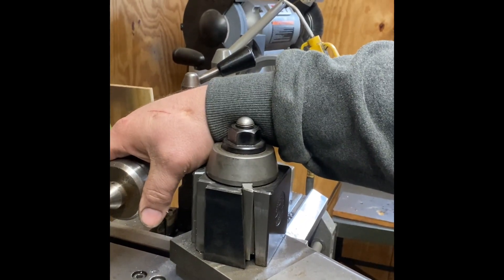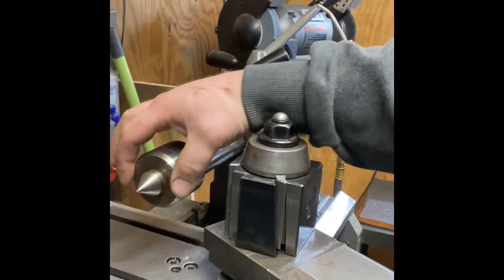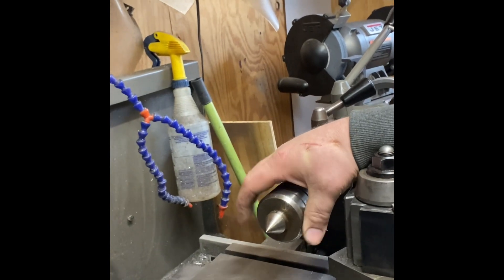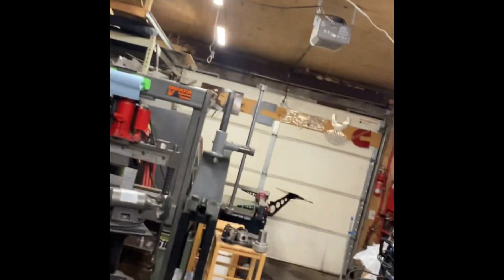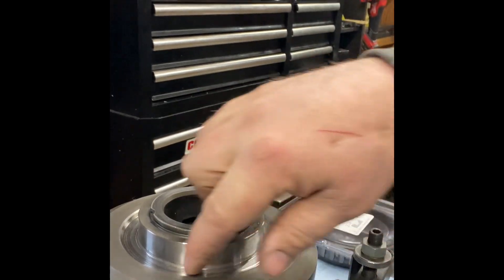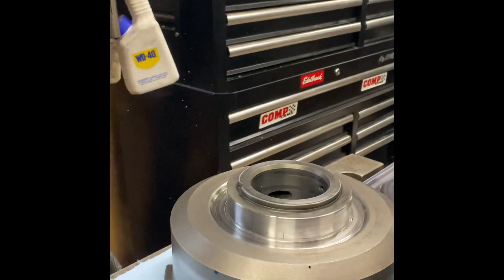I have a larger piece for my tail stock to steady it up — it fits perfectly in the drum — just for support to get rid of the harmonics, because it was leaving some waviness. If you have a bigger lathe you'll probably have no problem. I took a nice clean pass, and even if it had some grooves from vibrating I think you'd be fine.